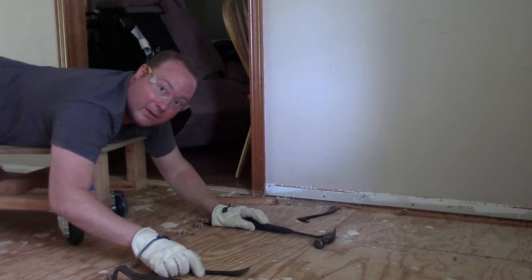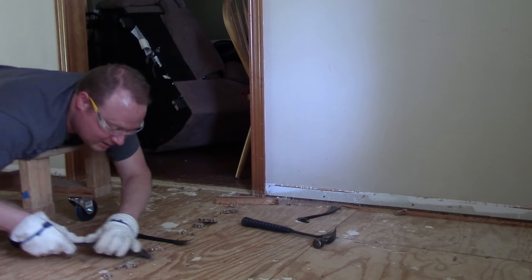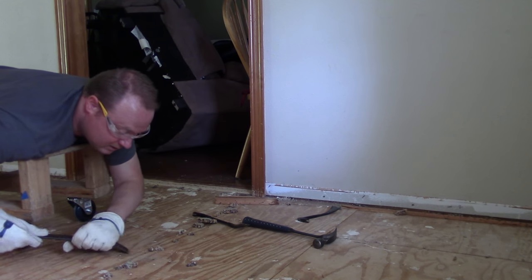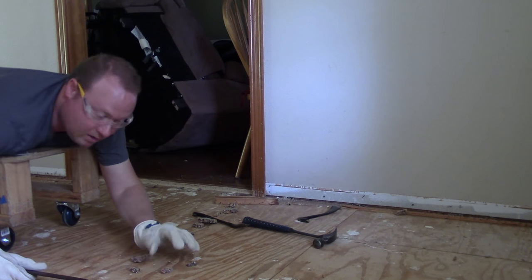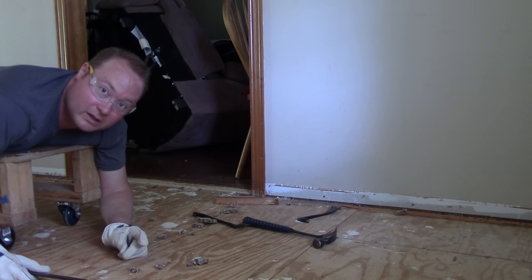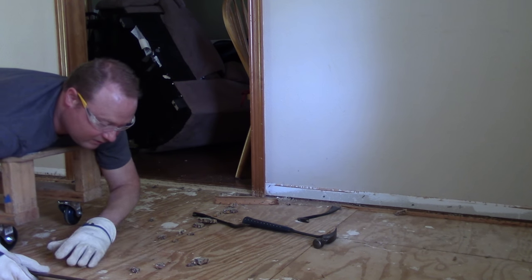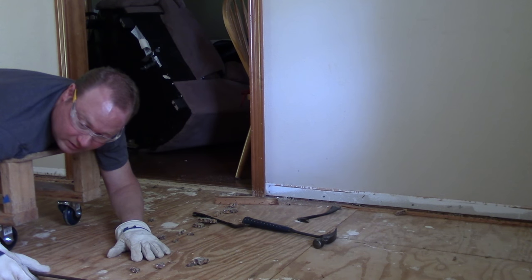You can see staples now, which can be a pain. We've got to get rid of them. A lot of times all it takes is a scraper or a pry bar to knock them out. If the staples are still there after getting the padding out, you can hammer them back in as long as they go down and stay snug. They don't all have to be completely removed, but the floor has to be smooth — we've got to get rid of any staples sticking up.